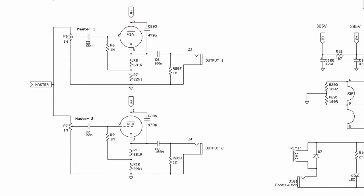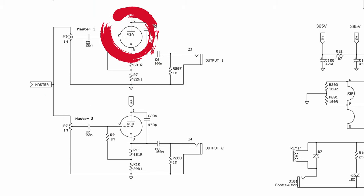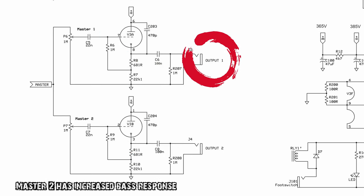Section of the preamp before it leaves finally to the power amp, you get two masters with different resistors and capacitors using different pins of the last tube. One of the master outputs is absolutely not usable due to basically no low end, and let me tell you, this preamp comes with basically very little low end.